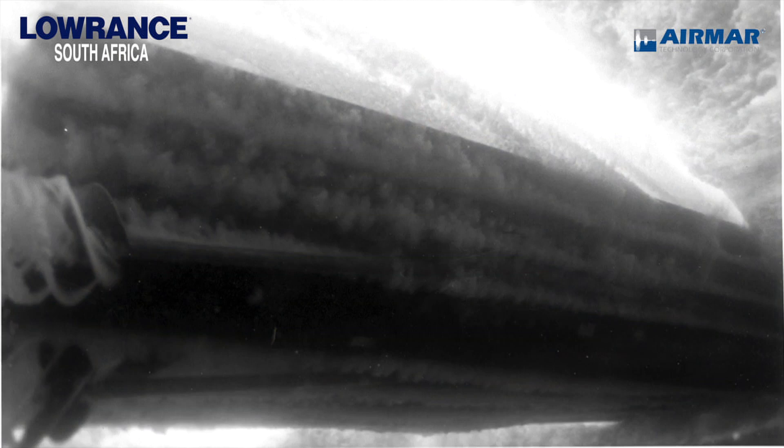One thing I want to talk to you about mainly — you spoke about a boundary layer, which we know as the bubble trail that goes underneath the boat. The boundary layer is the layer of bubbles that travel down the hull as the boat goes through the water. The longer or the heavier the boat, the thicker that boundary layer becomes. So it's really important to get the face of that transducer past the bubbles, so you've got it running in the cleanest, least aerated water.